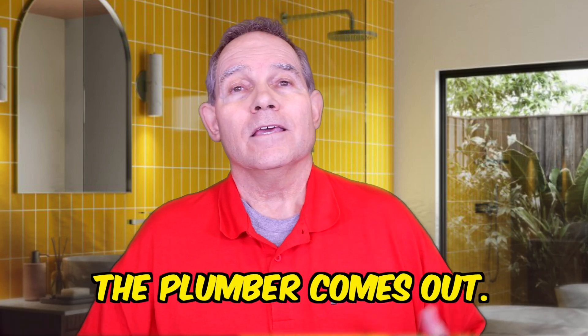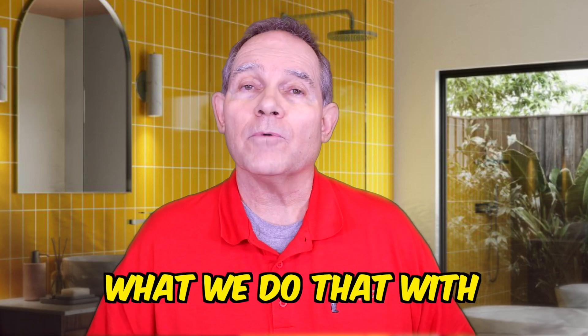Why do we air test gas systems? To find a leak. What we're going to focus on today is testing the system. You smell gas, you call the gas company. They come out, find a leak on your home — and oddly enough, most people think the gas company is going to fix their leak, but they don't. The gas company says call a licensed plumber. They shut your gas off, and now you're without hot water or heat. In the middle of winter, that's a big problem. The plumber comes out and we have to put our own test on it — and what we do that with is air.